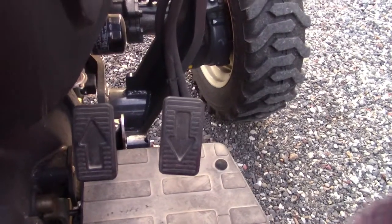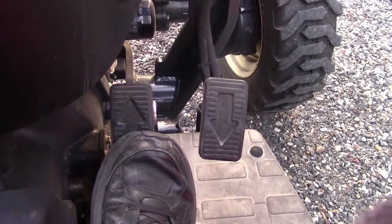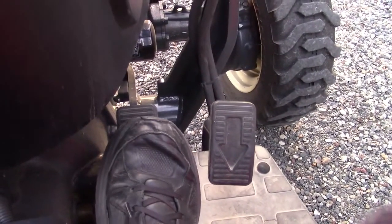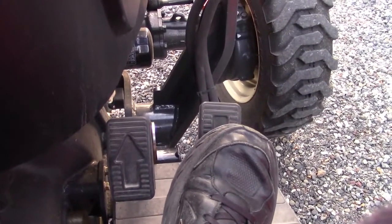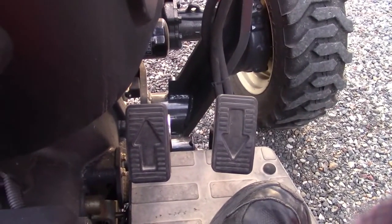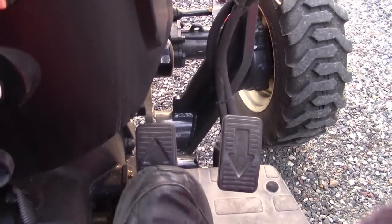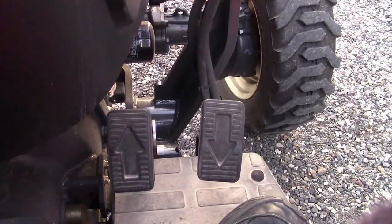If it's still not turning over, make sure you don't have your foot on one of the foot pedals. On this tractor, it's a lot like the average garden tractor where you have hydrostatic drive. Push on the forward lever — the farther down you push, the faster it goes. Pushing reverse works the same way. If you put any pressure on those pedals at all, the engine won't start.